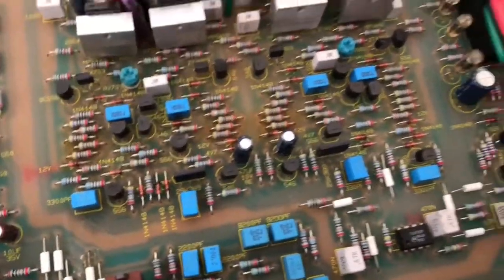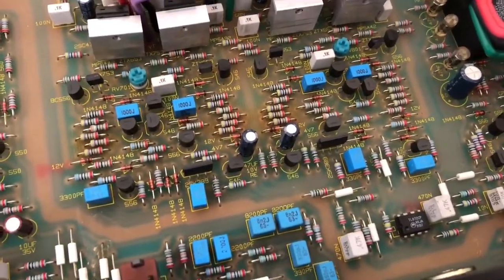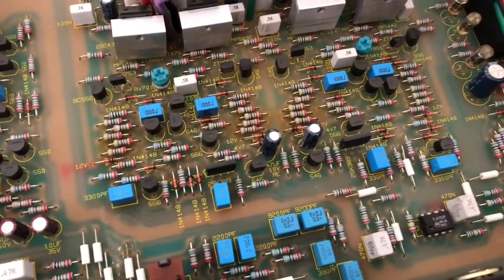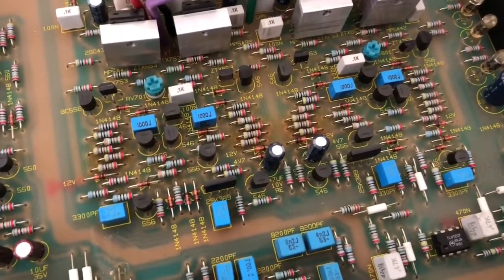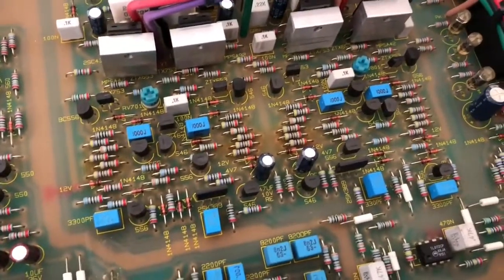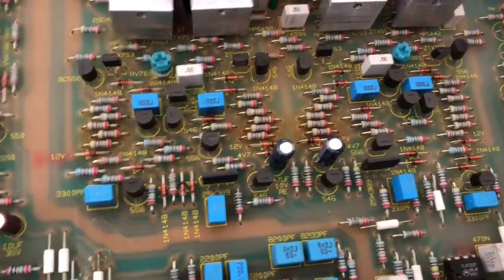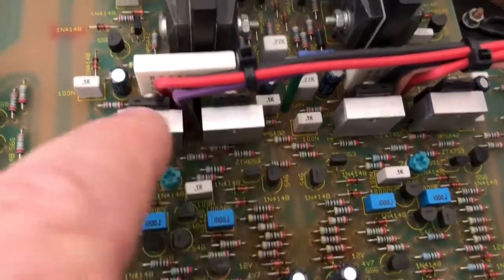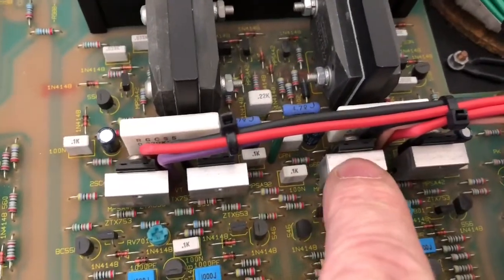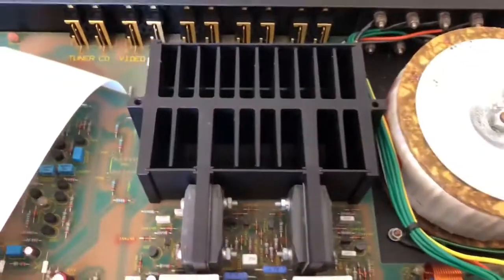These things are not cheap. AudioLab has done this because it's a great way to go from an electrical standpoint. They have a super high input impedance, meaning they essentially draw no current from any source — they don't present a load to a source, which is the way an ideal circuit element would work. FETs are just fantastic things. All the way through here we've got conventional bipolar devices, all discrete. We've got some higher current devices mounted to little aluminium blocks which heatsink them nicely, and then the Sanken complementary pairs mounted to this beautiful machined aluminium heatsink.